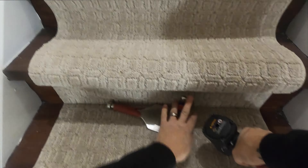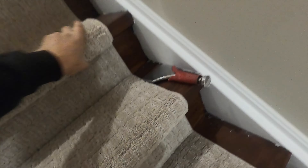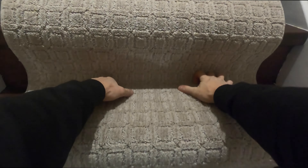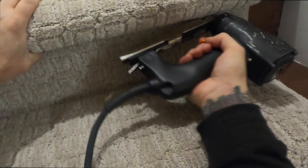Take your tape measure, measure up, get some staples first. Put pressure on the kicker, staple the sides, score the bottom of the stair, then put staples one inch under the nose. Every five inches down below on the riser, score it again. Bend it up and go one inch under the nose all the way across — that's how it's done.